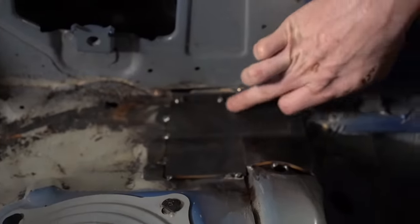Your next point is going to be the distance between the two bends on the top. This car is very oddly shaped, so I have to do some double checking with a couple of pre-bent tubes to make sure that it's going to fit. But I basically am seeing that I'm going to start with a 38 inch between the centers of each bend at the top, and then I'm going to confirm that with a couple pre-bent pieces that I have and make sure that between the two centers I'm able to fit that inside of the car.